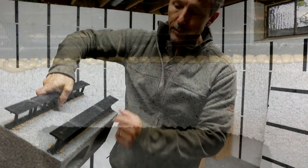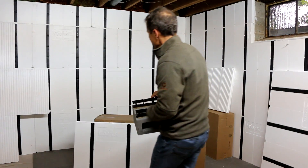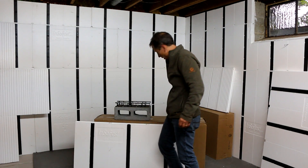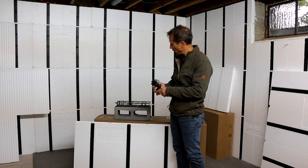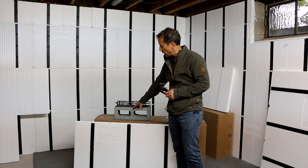At 108 pounds per lineal inch, and this is about 16 inches long, that's 1,600 pounds worth of pull-off right there. A screw or nail is going to pull out of this before the glue will give up on the concrete block.